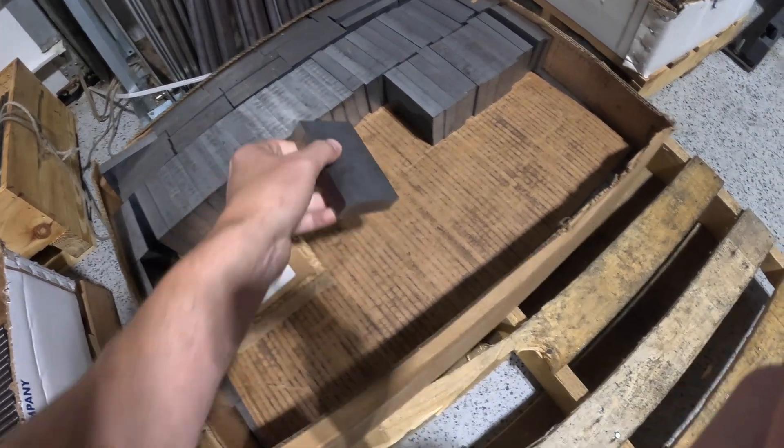These parts are a great example because they're made out of 4140, and most 4140 is saw cut out of plate — there are far fewer bar or rolled forms than there are mild steels. We end up with some variances. We order these about a thousand at a time and I want that part centered so we don't risk a tool imbalance where it either doesn't cut or cuts too much on one side. So we sort them and run them in batches of three or four hundred. When we make a minor adjustment to the Modvise, you end up shifting the part, and that's what made me rethink how to better handle this.